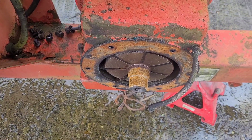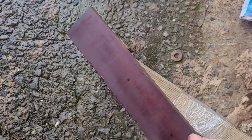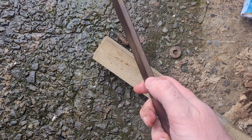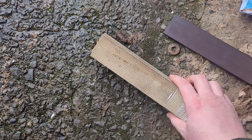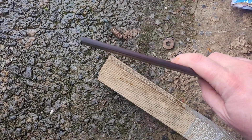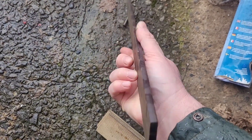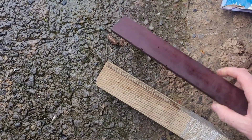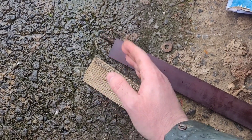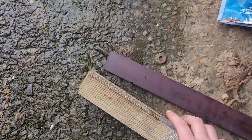I'll show you the new vanes now. They're sort of like fiber, and the old ones — they look like a piece of wood. Measuring this up to order the new ones: the thickness of this is 7mm, and the new ones are 6.5mm. So they had swelled up, and maybe there's a bit of warp from the swelling in them. So they're a bit too stiff in the slots. These new ones will be half a millimetre smaller, so they'll be a bit looser in the slots.